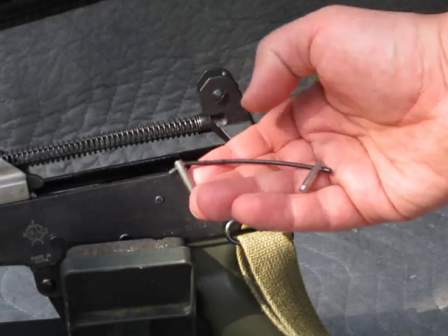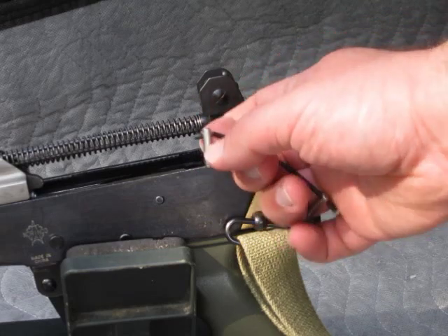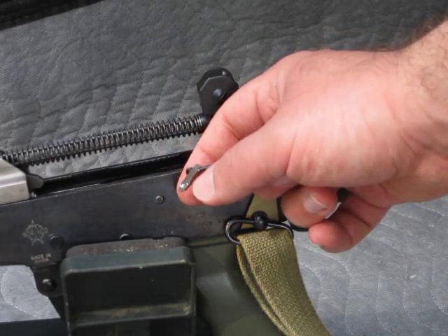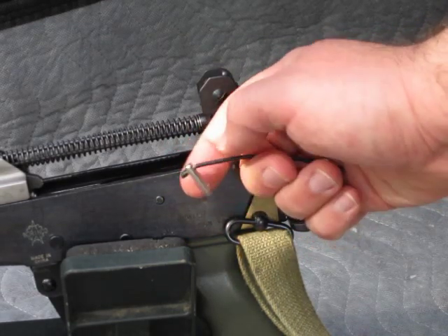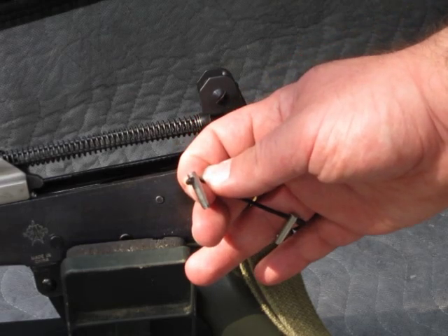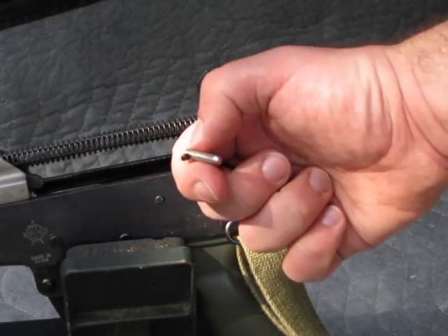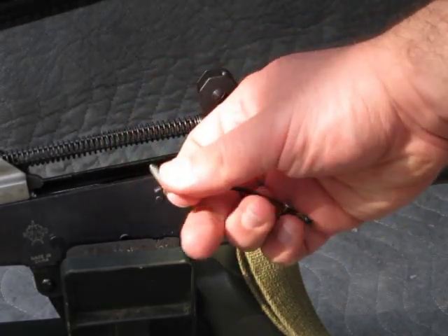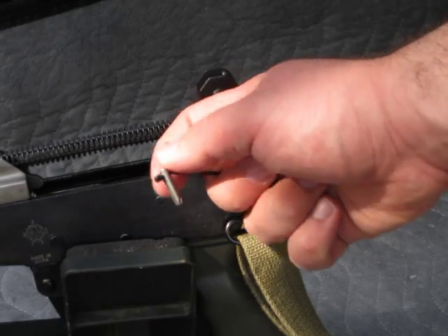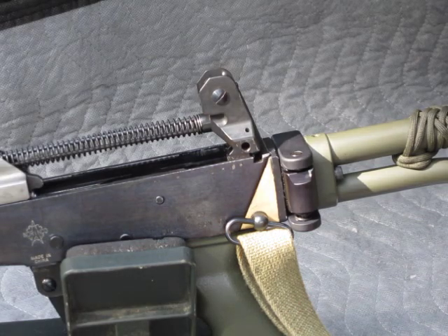This is just a piece of 1/16th inch stainless steel wire rope, plastic coated. On each end I have a 3/16th inch quick-release pin with a 0.4 inch usable length, made out of 18-8 stainless steel. On the end I have a bit of stainless steel tubing, about 1/8 inch outer diameter. I threaded the wire rope through there and crimped it down with some pliers. I then Plasti-Dipped both of the end pieces — not the pins, but the bits of stainless steel tubing on the extreme ends.